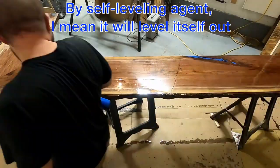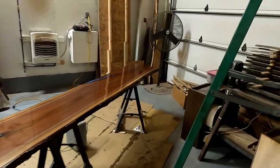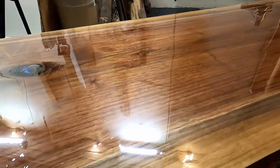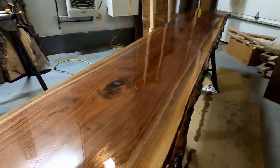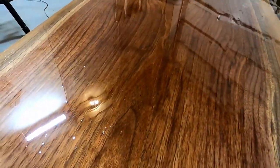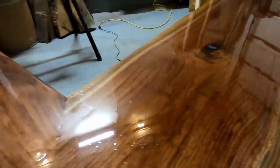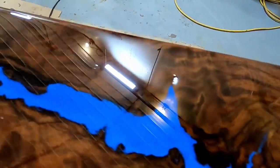After one seal coat, this is what you're left with. From a distance it looks pretty good, but when you get up a little closer, you're going to notice all the little imperfections, such as all these little bubbles. Now if I had just poured one coat and stood there with a torch, I would still end up with these, because the bubble is caused by epoxy soaking into the wood grain — it's going to be a constant thing until the epoxy dries. So I'm going to sand it down using 220, just kind of lightly sand it, and pop all these little bubbles with the sandpaper. There are some pretty large little voids that are just going to keep pulling that epoxy in, and if you didn't do the seal coats you'd never get those filled.